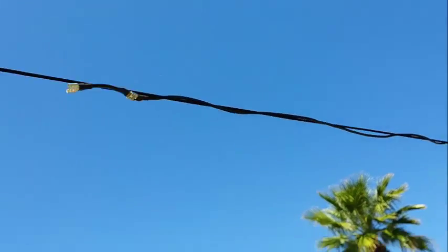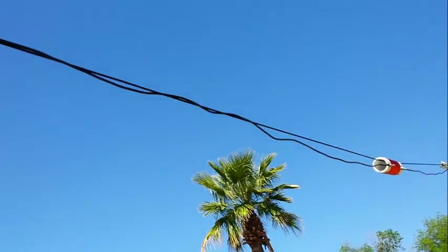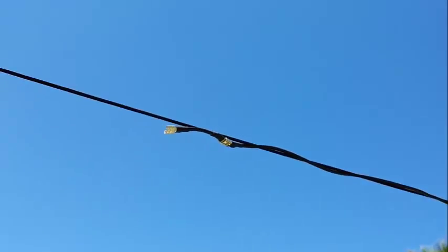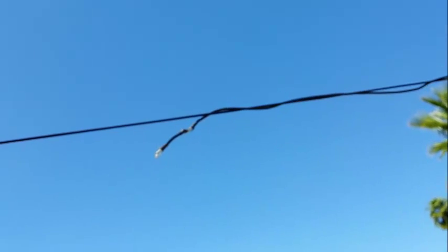The only compromise in this antenna is it's very high Q at 75 meters — you're good for about 40 kilohertz between the two 2-to-1 SWR points. So I made little jumpers here using spades: a 2-inch and a 4-inch, one on each leg. There's a coil on each leg identical to this.